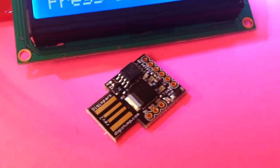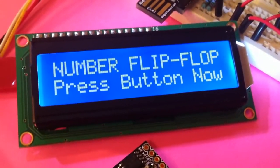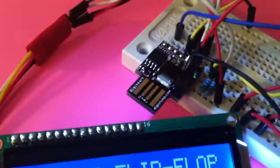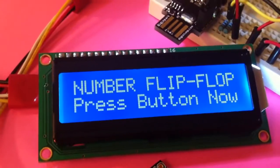I have this one, and a second one here. I have one hooked up to this LCD display — it's a 16-column, two-row display, and the DigiSpark you see over here on the breadboard is driving this display right now through an I2C line.